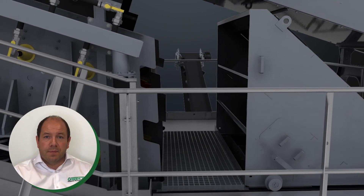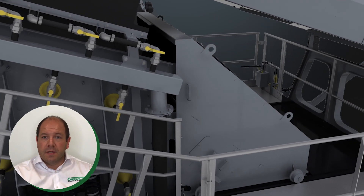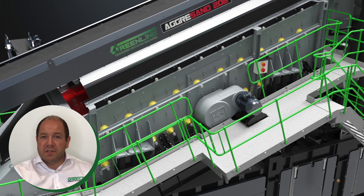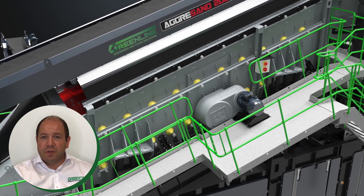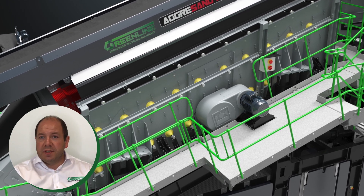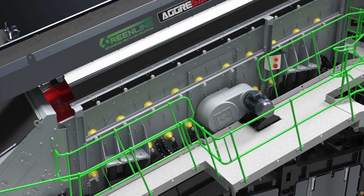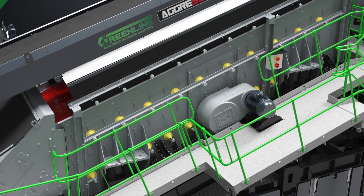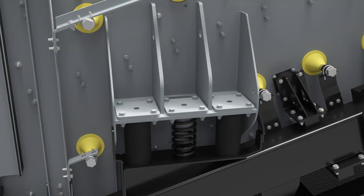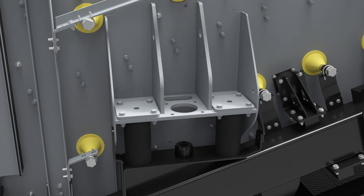While the core screen box is the same, we have made some design updates to reduce maintenance time for our customers. The drive motor is now mounted on a self-adjusting isolated mounting table, dampening movement during start-up and shutdown. We have also introduced an easy spring replacement feature to eliminate the need for lifting equipment and reduce potential downtime. This short animation demonstrates how a maintenance bolt is used to contain the spring while the smaller top retaining bolts are removed, then slowly releasing the spring which is replaced, providing a safe and controlled method of replacement.